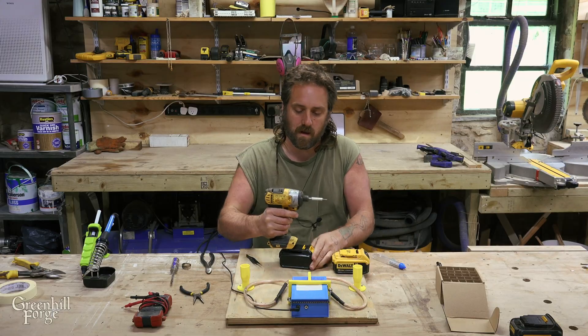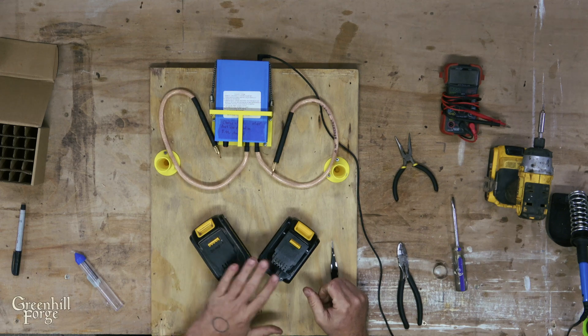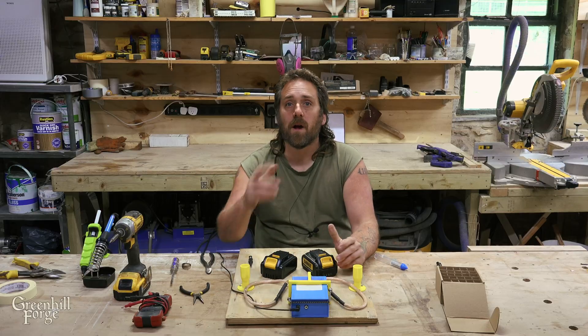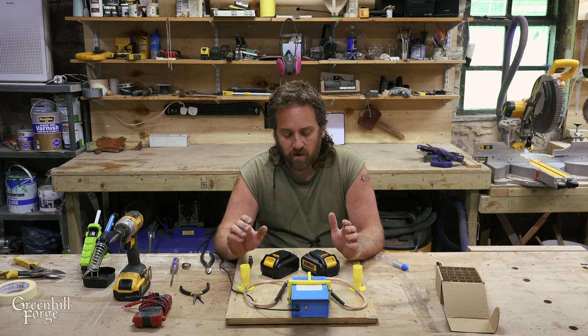So I can test it — it's working great. 55 bucks for two brand new 5 amp hour batteries that would normally cost probably about a hundred bucks retail. Even just doing one of them, I paid off the spot welder. Anytime my older batteries start to slow down, I just rebuild them and they're basically brand new and last me another several years. If you found this entertaining or helpful, really appreciate a like and a subscribe. If you have any questions or comments, throw them down below and I'll try to help. And again, if anyone was going to try this, you've got to really know what you're doing and be really careful because you could electrocute yourself, cause a fire, or they can even explode. So it's not something to take lightly, but if you know what you're doing, it's a great way to save some money. It's fun, and you end up with some brand new batteries. Thanks for watching.